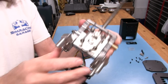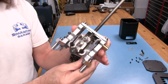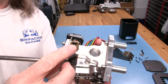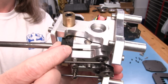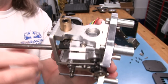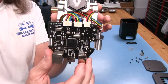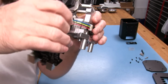The shifting mechanism is made from CNC aluminum. It is a complex-looking piece of kit that gives the impression of a high-quality build. It uses sealed bearings at crucial pivot points. There is a tension adjustment element that uses a spring-tensioned ball bearing riding on a nylon plate with indentations to simulate shifting gears. The good news continues with the electronic solution that I found, a custom circuit board that looks to be well done. There are contactless switches which should give a long life cycle.